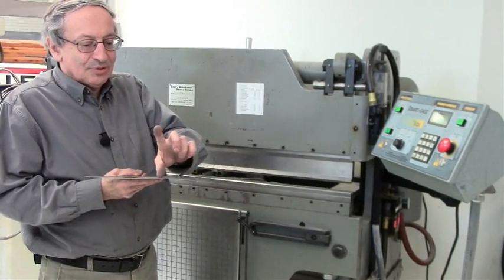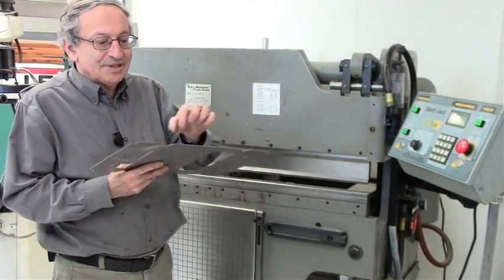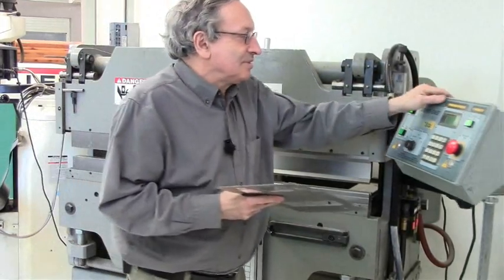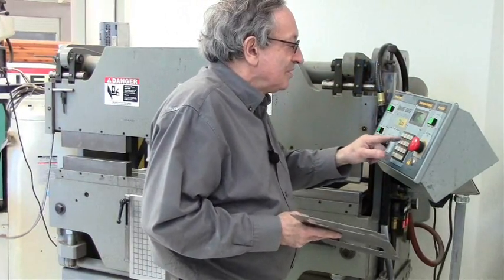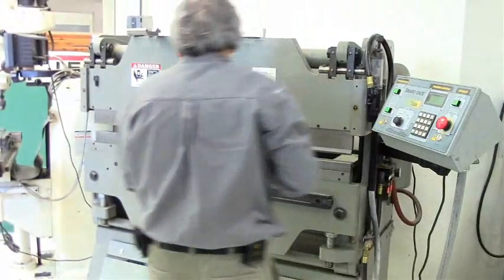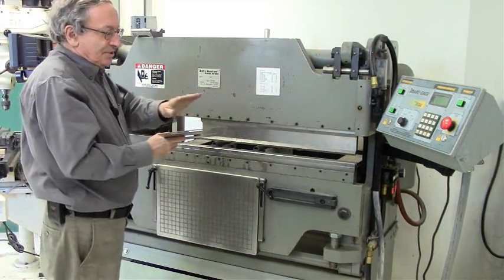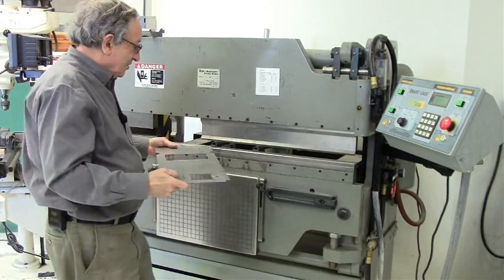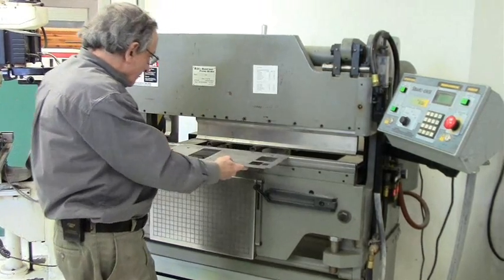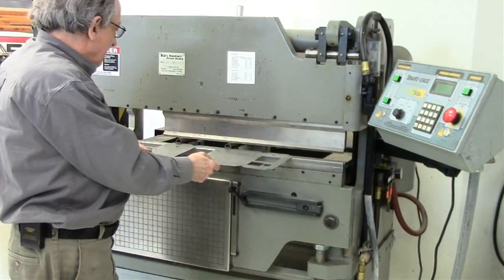The width is more than the height, so there'll be no problem bending — you don't need any special tricks. These are 15 millimeters, so we bend the periphery first. Next position. Set it to 15. Double check. Double check the orientation. Good. We bend these bends first.